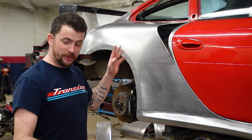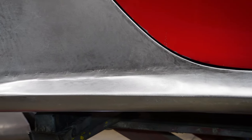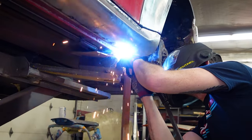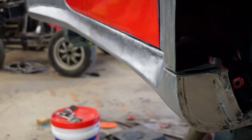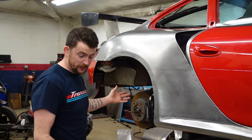That's why I cut a window in the tub, and it's painful to cut something that you made painstakingly. It took me an entire day, almost, to make that tub, and I cut a big window in it. What we did in the past couple of days on this rocker was: I welded the seam up here, plug welded the bottom, capped off the end, and installed and welded the entire tub in.